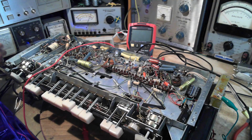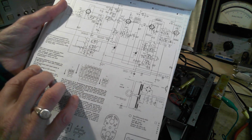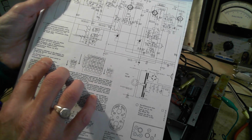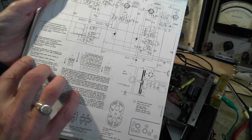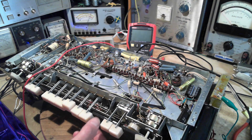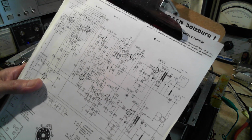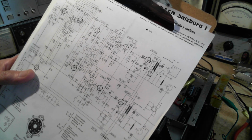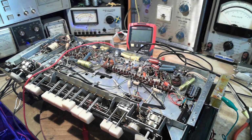So I'll be using a vacuum tube voltmeter, which is probably a little better than that. I don't know what the rating would be on a vacuum tube voltmeter. I'd have to think about that. All measurements with wave switch in position FM, underlined ratings in AM position. So I should have the radio in the FM mode, and somewhere in here, some of these voltages must be underlined. I don't see any offhand, but could be there's not an awful lot of change.